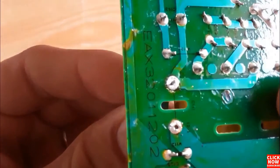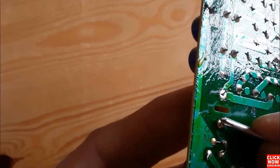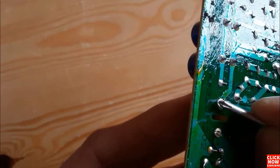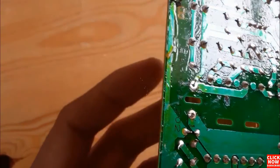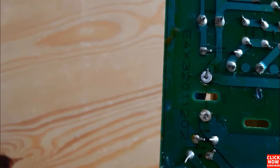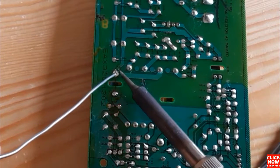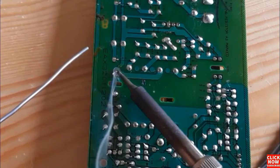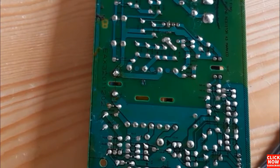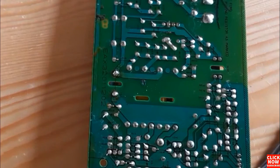Let's connect the ceramic capacitor back and solder it to the motherboard. The ceramic capacitor doesn't have polarity — it's not a polarized component, you can connect it either way. But as mentioned, for electrolytic capacitors you must pay attention to polarity, plus and minus. Bend the two terminals slightly to fix it to the motherboard, then apply the solder — solder the first terminal, then the second one, and clean up.